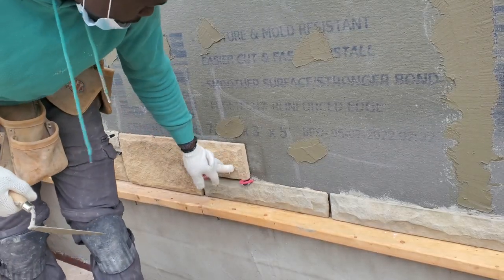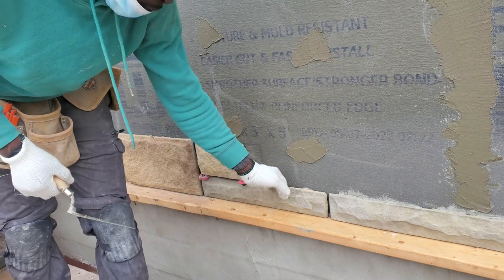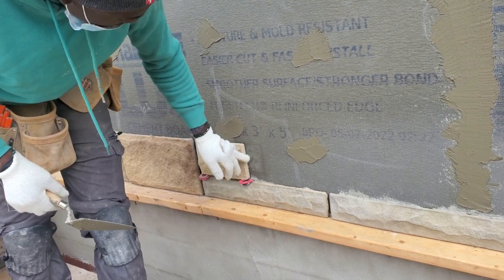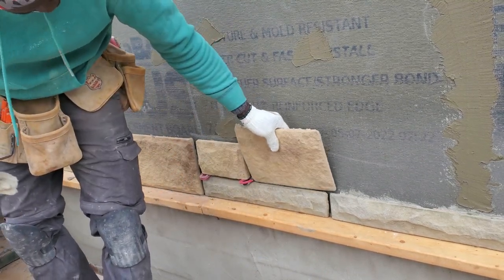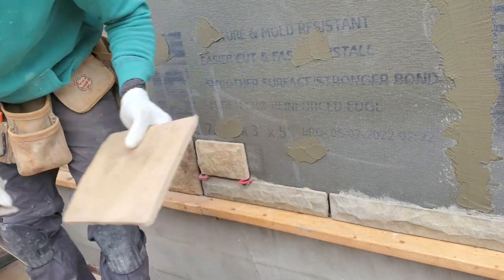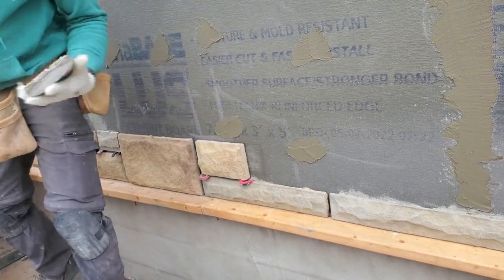Now that we have this one here, we need to put a different size to break the band. We already have a small and a medium here. This stone we're laying is a three-dimension stone, so we only have small, medium, and big. In order to break this band we have to put a big one here because we already have a small. You want to always stay away around four inches from your joints, so we're going to try to find a bigger one or extend this one a little further so we can put that stone right there.